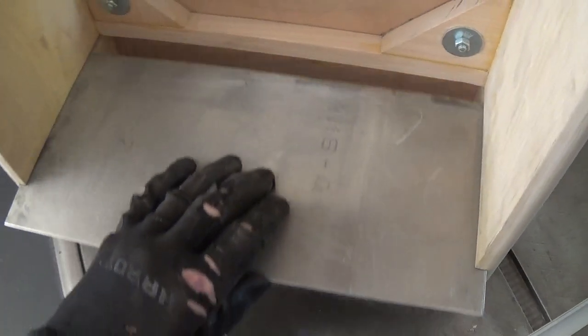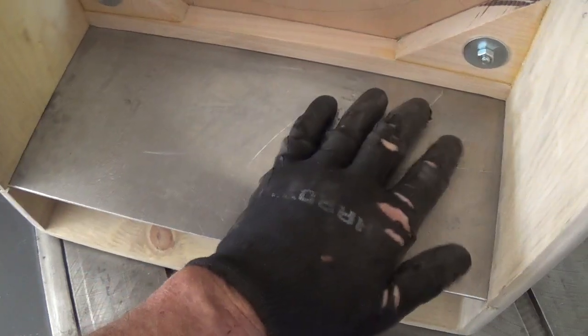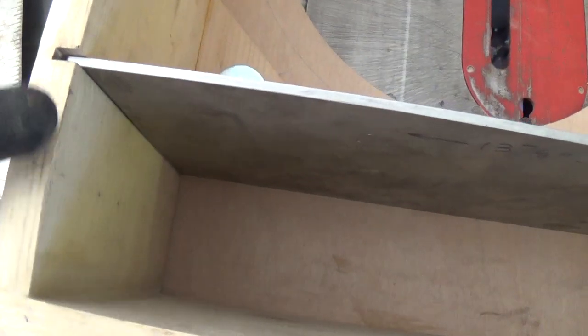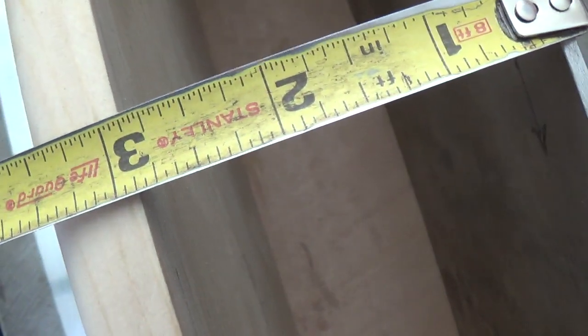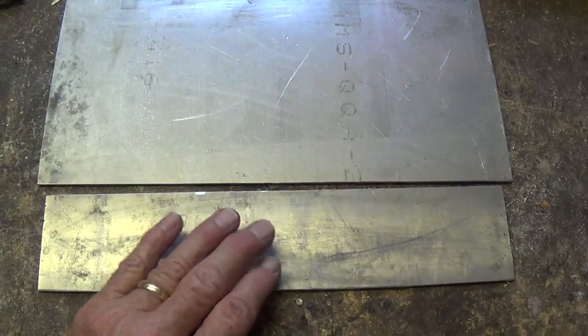This now will be the upper surface of our amp chassis. Next, we have to make the measurements for the vertical control panel. Bear in mind, it's going to go from inside to inside, and that distance will be diminished somewhat by the fact that material will wrap around here. So we'll deduct a little bit from our measurement to compensate for that. Looks like about 13 and 3/16 by 2 and 3/4 ought to fit pretty well and leave room for the material. And there, as if by magic, are the two plates that we need for a sliding chassis.